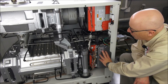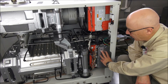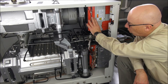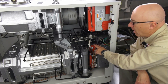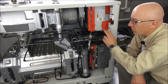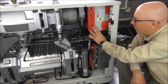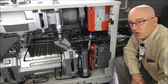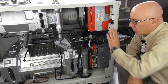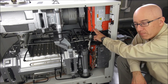The controller provides the intelligence and the programming to run the GXS and provide all of the routines for operating the pump. The inverter runs the motors of the dry pump (DP) or of the mechanical booster (MB) and rotates them at the correct speed — for the dry pump that's 110 Hz, for the booster that's 102 Hz. Because these variable frequency drives can have their speed infinitely varied, we can control the pumping performance of both the GXS DP and the MB. The inverters also provide protection to make sure the pumps and motors cannot be overloaded.